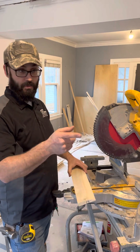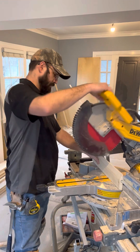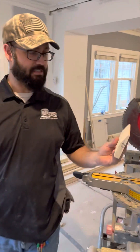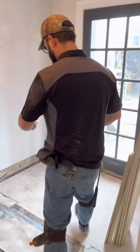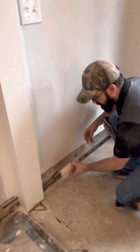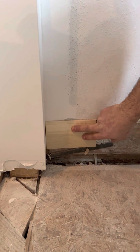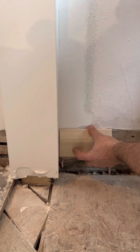I'm going to cope corners real quick. The first piece is a square cut — take that piece, square cut both sides. This doesn't actually fit here, but this is as if that one went there. I'm just going to tack that in just like that, and then we're going to cut our second piece with a cope on it.